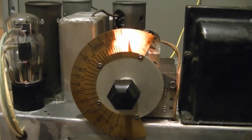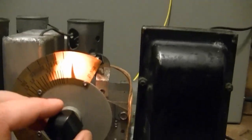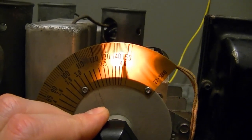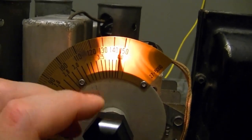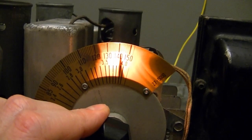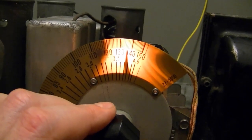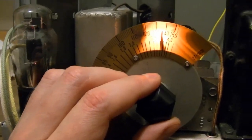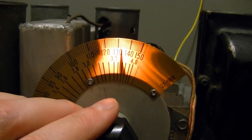Okay, I disconnected and shut down all the test equipment. I've got an antenna hooked up that's about 4 feet long and just going up straight. Just starting at the high end of the dial here on the AM broadcast band. Did the best I could with the HF and LF oscillator trimmers to get the dial pointer to line up, and it's not off too much on the stations I recognize, but it's not perfect. Sounds pretty good. Oh, and I'm picking up plenty of stations too, so the sensitivity is pretty darn good.